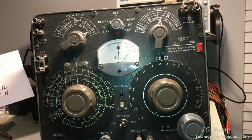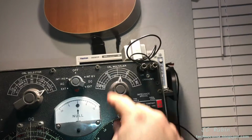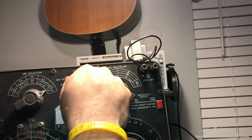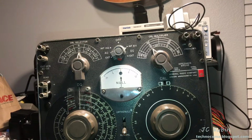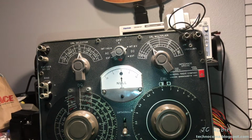So we'll see what the new one is, how far off it is on this. But yeah, wow, how about that? So I got the new one propped up on there. I'm going to start these tests all over again. So I'm seeing 64 ohms on the new one. That's just fine. Now we'll test inductance.